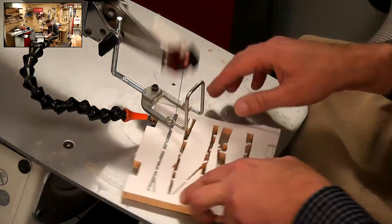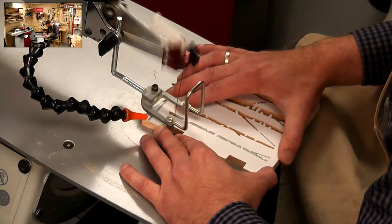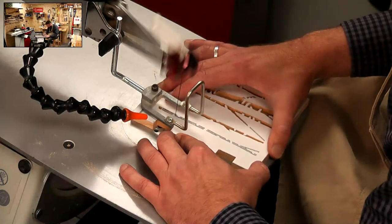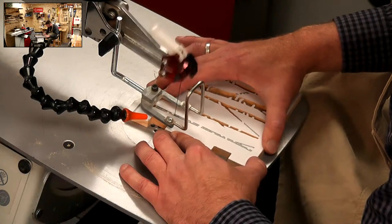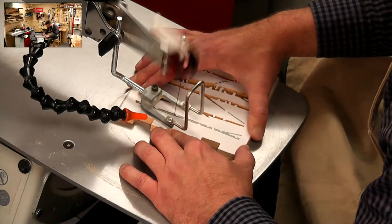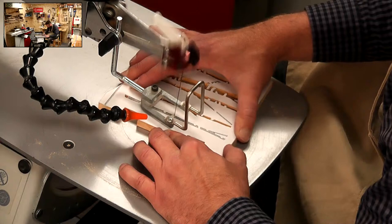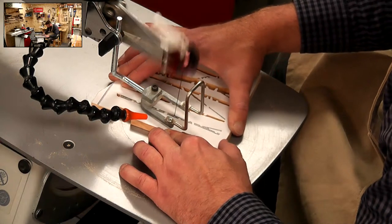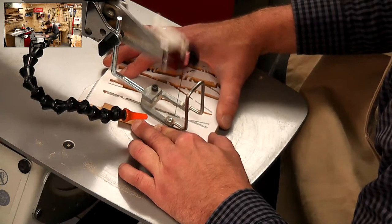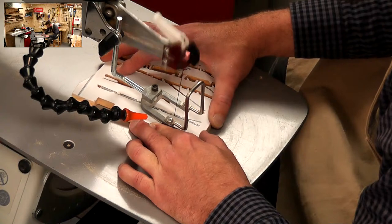So extractor back on. And let's switch it around so I'm not using the back of the blade. Remember, that felt a little bit dull. These blades do wear. You should get at least half an hour's cutting time, depending on the thickness and if the wood has silicates and things like that in it. So they do blunt, but they are not very expensive. They're almost a consumable.